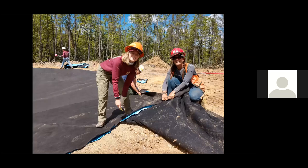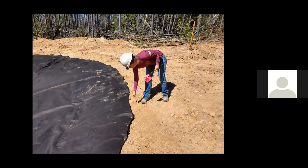We trim off all excess material that will be above the water level. We want this entire liner covered with at least 15 centimeters of soil — we don't want to see any portion of the liner. If you can see the liner, it will deteriorate and become very hot, killing amphibians going in and out of your wetland. We mark the top cut edge with wire flags so the excavator operator knows where the edge of the liner is — we do not want any heavy equipment to travel over the liner, as it will cause differential compaction, shear the liner, and it will not hold water.